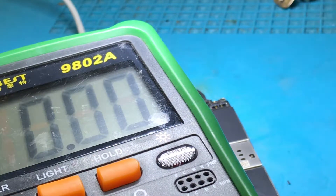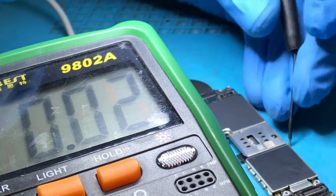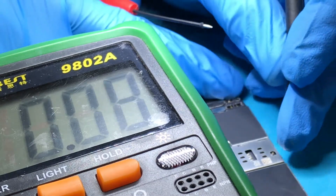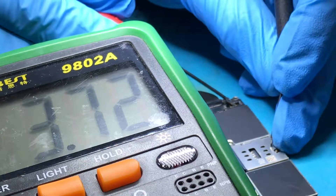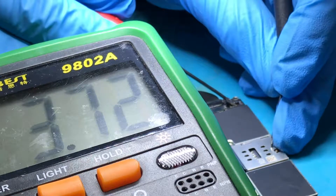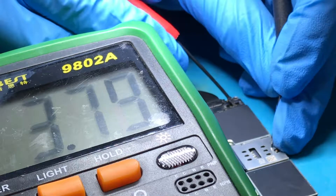I'm going to come here and stick one on ground. So this 6s board is plugged in to charge. I'm basically going to check the voltage coming on the battery connector from being charged. This should be a steady 3.6, 3.7, 3.8 — steady, no drops whatsoever. As you can see there, that's dropping, which means there's probably a short on this TriStar.